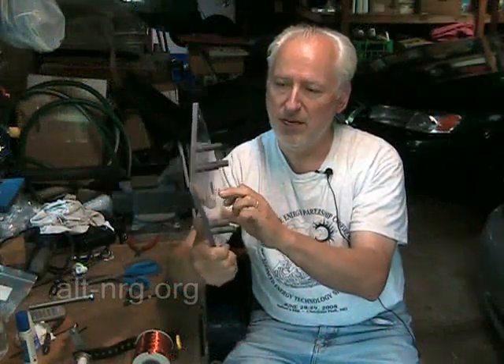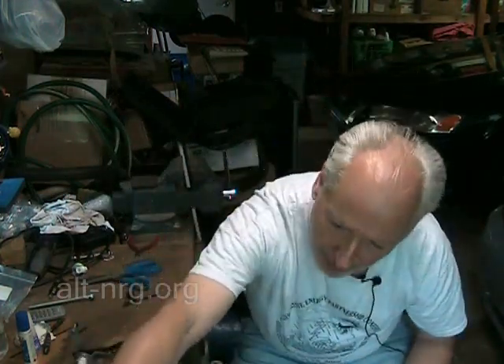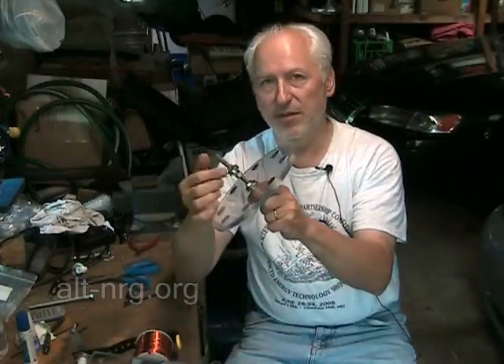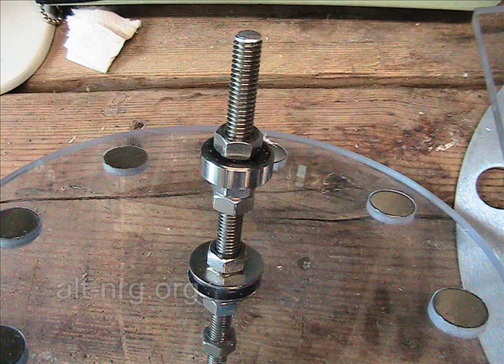Last night the glue set up and everything's all set for today. The bearing races are now permanently fixed to the rotor shaft so that I can just assemble the stator halves to both sides, and there's no possible way it can get too close to the ferrites where it will clamp down onto them. That's a good thing.